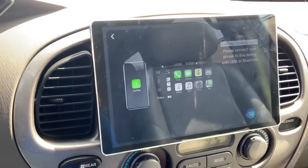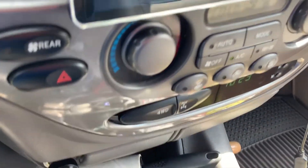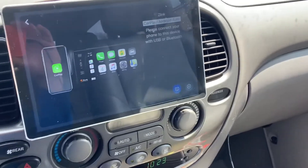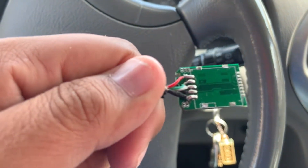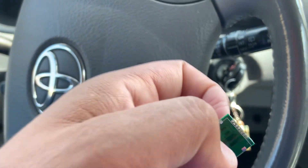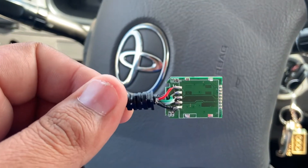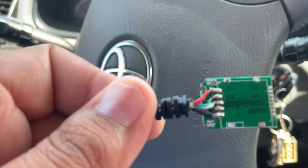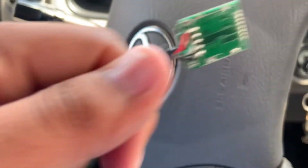Yeah, I just wanted to share that too because I touched on it last time that my update broke things, and I'm sure people are going to ask what happened. Other than that, I wanted to give that pinout information in case somebody needs it in the future — if they break their SIM tray or it's no longer reading the SIM card, you don't have to stress out; you can probably hardwire it. I'm going to try hardwiring here. I think this was my issue — the last day I used a coat hanger clip to hold the SIM card to the tray and it was working for long periods of time, but hitting bumps would make it wiggle and I'd lose signal again. So I'm going to cut and re-solder to get new connections. This will be just the first part.